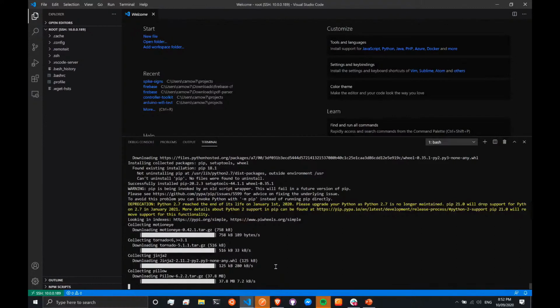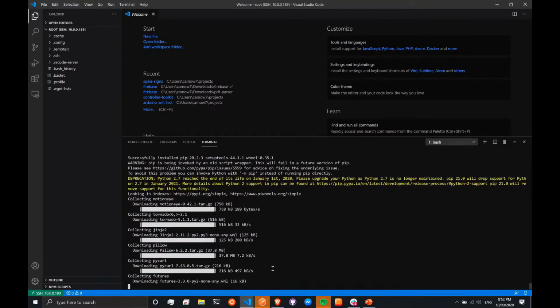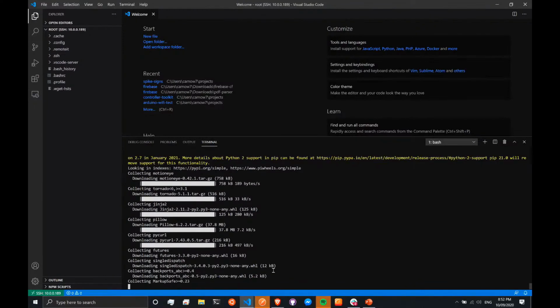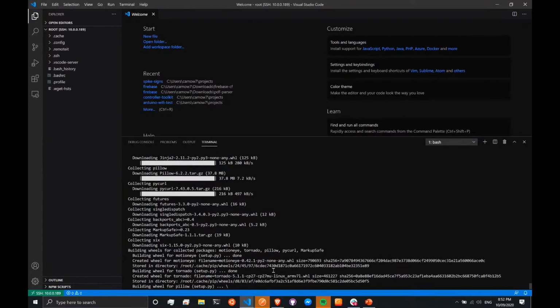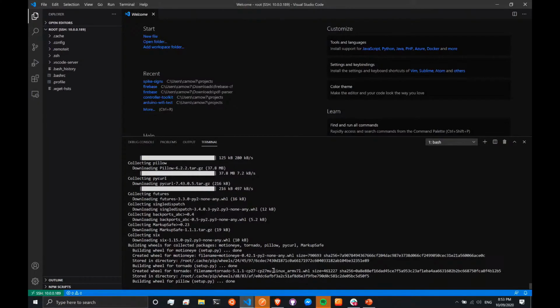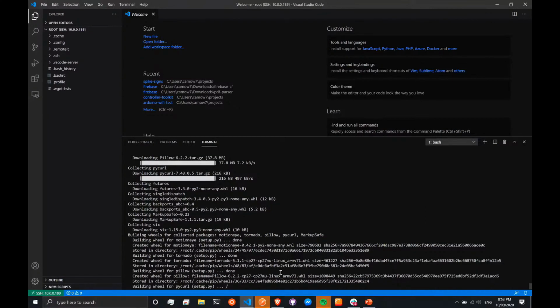With this particular setup, I am taking the power load off the Pi a little bit by running them all off a powered USB hub. But I have tested it. The power requirement for the camera comes from the fact that it has infrared. At night time, the infrared lights turn on and start drawing some current. But I have tested just running the camera on a Pi by itself, and it did have enough grunt. At least the Raspberry Pi 4 had enough grunt at the USB ports to run 1. I tried running 2, and that's where it fell over, but I didn't expect it to, to be honest. I was surprised it ran 1 at night time. In the daytime, no problem, not heaps of power, but at night time, once it's pumping the IR lamp, it starts drawing a bit more power.